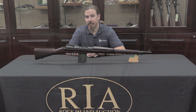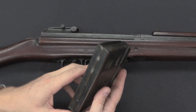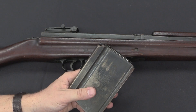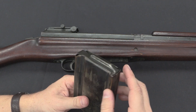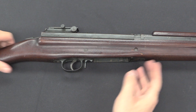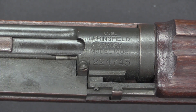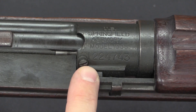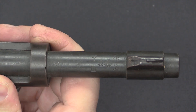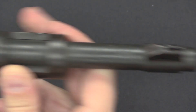What we have here today is an example of an attempt to convert a bolt-action 1903 Springfield rifle into a semi-auto .30-06 rifle. You can see it's got a BAR magazine in it, and parts of it kind of look like a 1903 but with some weird lumpy growths. Most semi-auto conversions at that time did use BAR mags — this one's been slightly modified at the front to feed better, and at the rear as well, but it definitely started out as a BAR magazine. If we take a look at the receiver, it's marked US Springfield Armory Model 1903, serial number approximately 1.22 million, which indicates it was manufactured in 1921. The barrel is also marked SA — Springfield Armory — with a production date of 3-21, March of 1921.